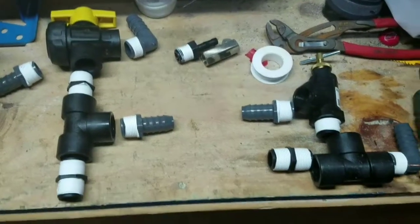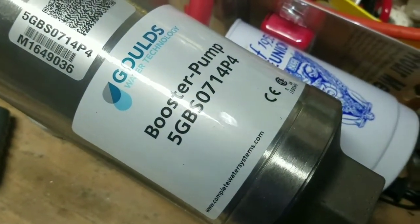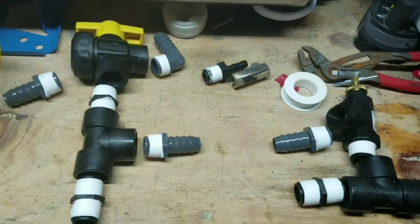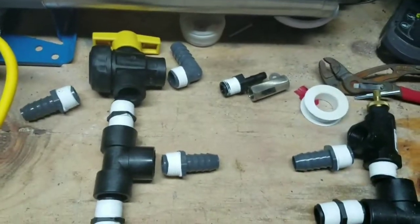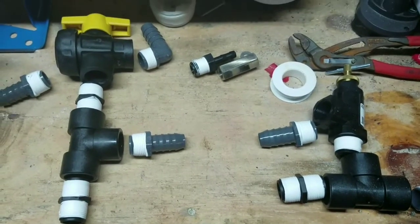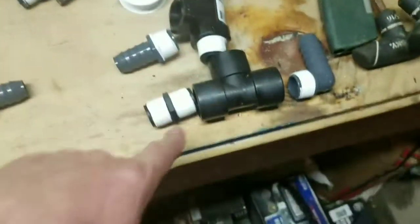Hey, what's up everybody? Rob Anderson, Clean Power Wash, Salisbury, Maryland. Working on a seven-gallon-per-minute Goulds booster pump — it's a GBS 7-0714-P4. It was $800 plus the recirculator kit. I've gone ahead and Teflon taped all the fittings based on Paul's video and one of his skids — this is the best configuration I can figure. All this is going to go up here for the inlet, and the outlet will come through here.